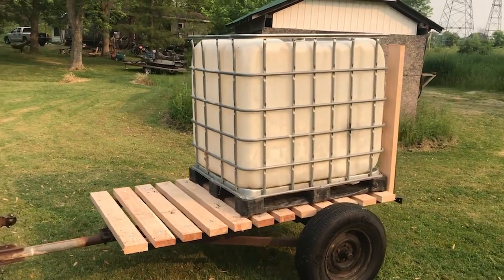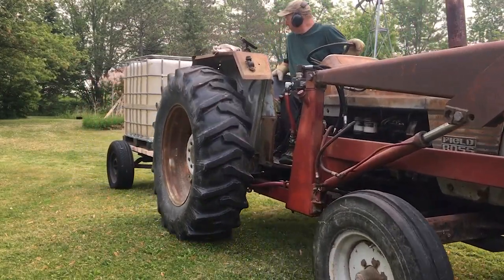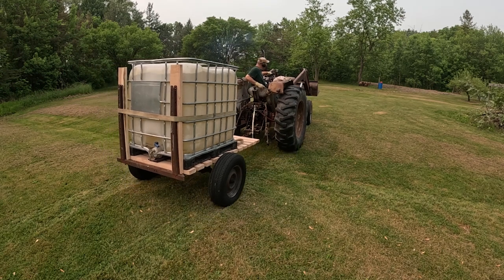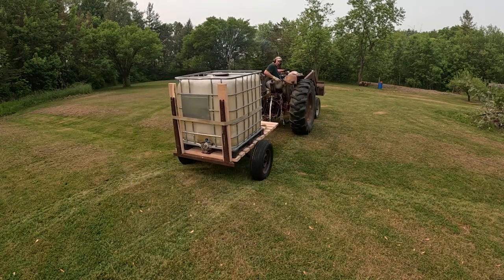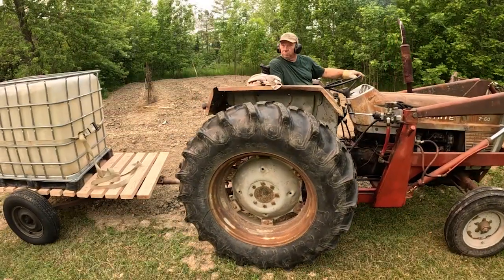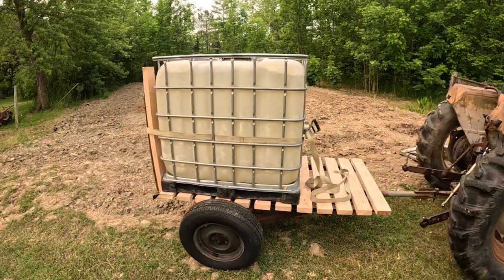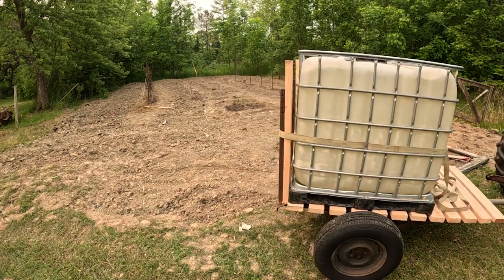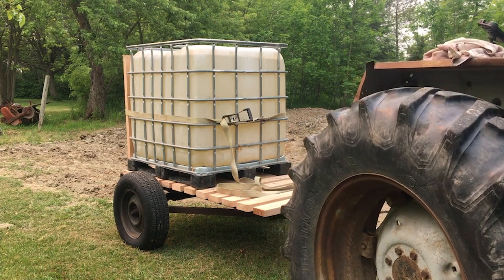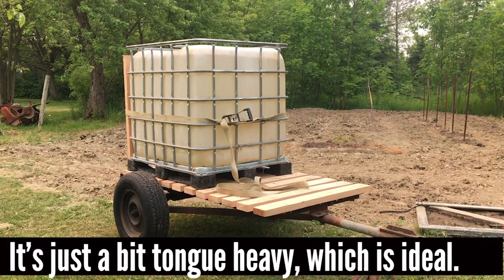The tank fits on perfectly. I'm going to have to put some little cleats around the bottom so it doesn't slide around, but for right now I'm just going to use this thick strap until I find out just exactly where the balance point is, so that I can take it off the tractor and it doesn't flip backwards or drive down into the ground. That open area in front of the tank towards the tongue is actually going to be a really handy spot. I water my garden with a 12 volt bilge pump and a marine battery, so I need a little bit of room — plus I use that same pump and battery with a hose to fill this thing at the pond. It's nice to have a spot where I can set all this stuff down. Maybe I'll make it a little enclosure so it doesn't get wet when it rains, but for now it works and I'm pretty happy with it.